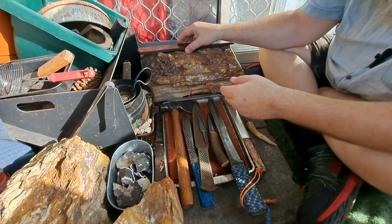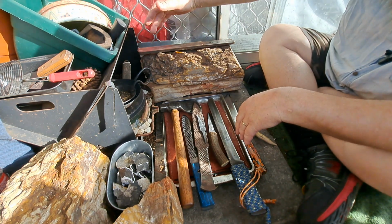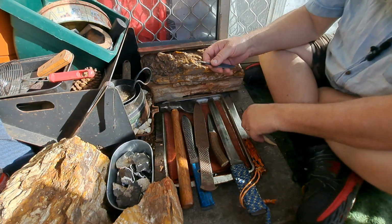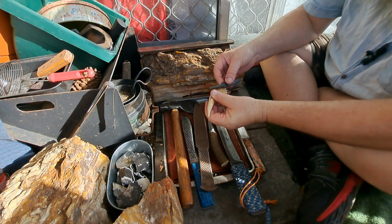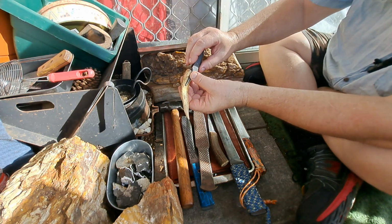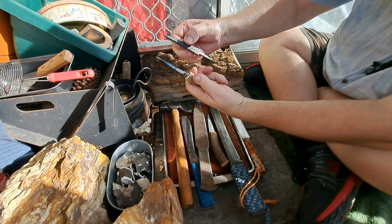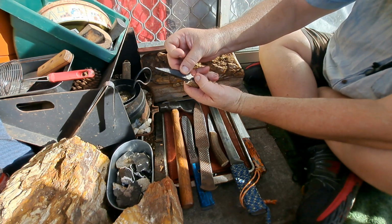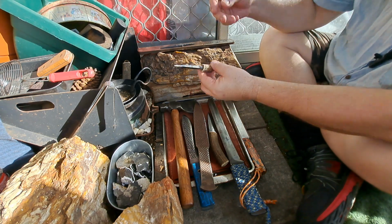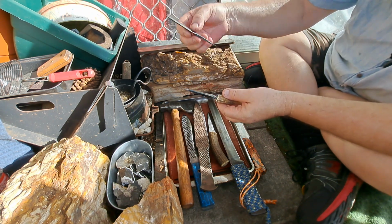But anyway, that's my W2. That's made out of W2 stock, 9.5 mils thick, just under 15 inches long. Yeah, looks really good. Precision knife. It's going to basically be antler. It's going to look like that. I've got a piece of antler that'll go in there, and that is what it'll look like. So it'll just have an antler handle on it, buried in the antler like that, and away you go. I'm going to fast quench that when that turns up. At the moment it's soft. It's been in the forge. I just had to restamp the O on it and fast quench oil it.